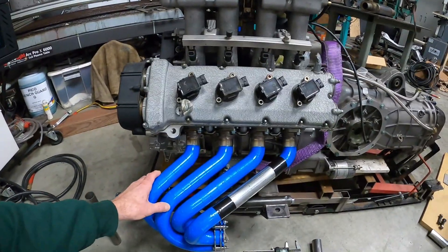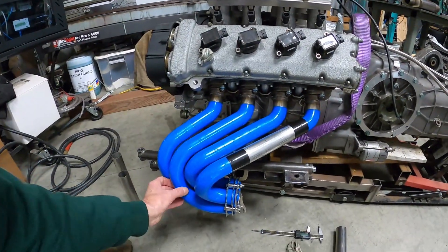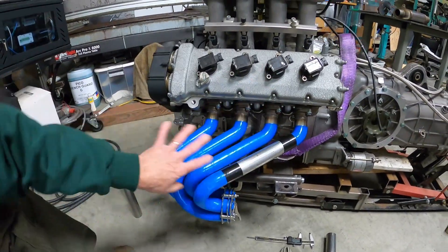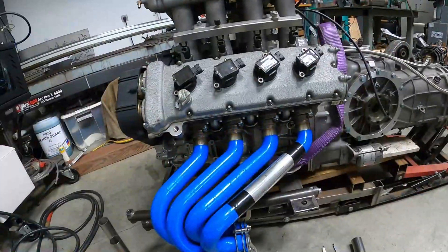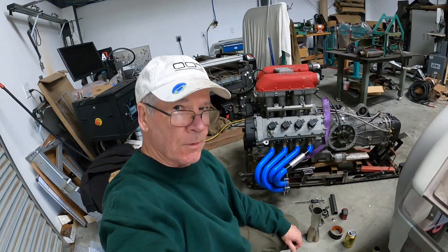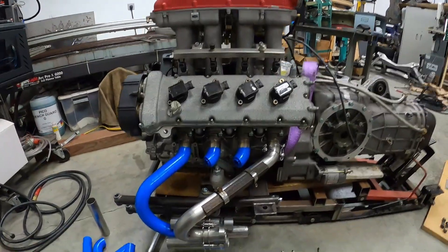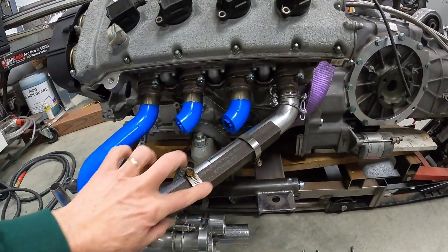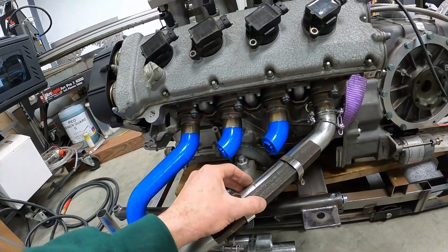I just quickly used the Ice Engine Works kit again to put everything in place. Now it's the same story of going in and replicating the cuts, fitting it in stainless, getting it tacked together, and away we go. So hopefully this will go a little bit quicker. A couple new things to try here — lessons learned from last time. We know this angle iron is a great way to keep these two tubes completely aligned.